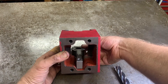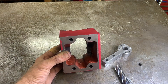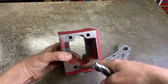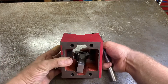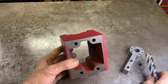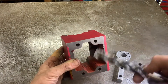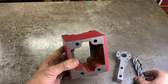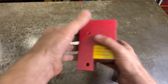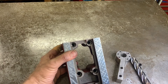I need to mount this like this, so I need to mill this surface flat right there — but that's not easy to do. I can't come at it from this way because this is in the way. It's about almost three inches long that I need to reach. I have a long fluted end mill but it's too big in diameter, because I need to get this arm located biased a little to this side. I need to eat into that corner and wall right there. To make it more challenging, there's an existing hole and four socket head cap screws with countersunk holes, so I have to figure out how to get a cutter in there.